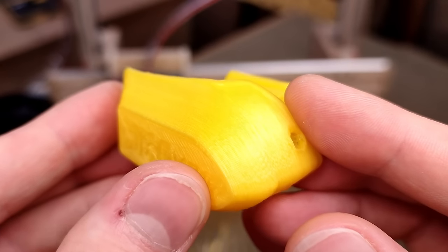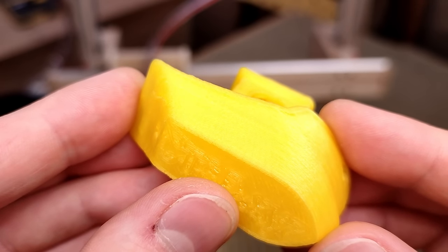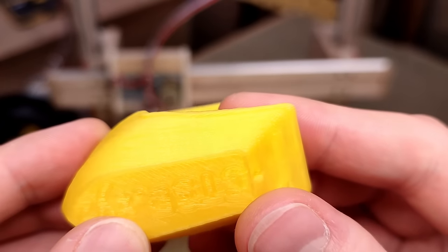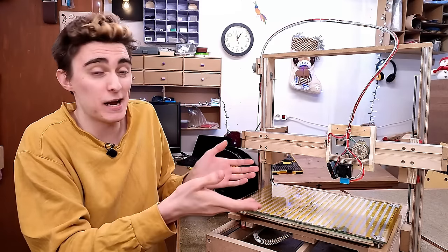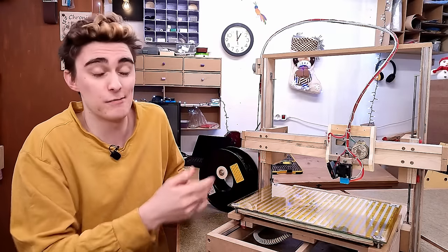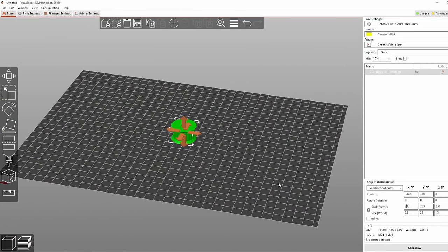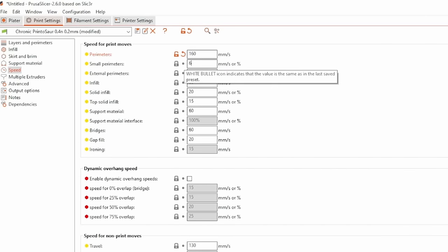On just slightly slanted lines, like on the hull of my Benchy, one motor still has to go slow, and that's where we get artifacts. But let's try out and see what happens anyway, because I haven't yet tried to crank up print speeds. I'm gonna print the exact same pulley again, except at twice the size this time, and the speeds I'm increasing to nearly 3 times of what I used before.